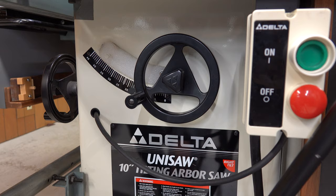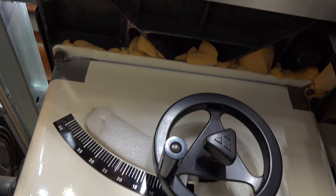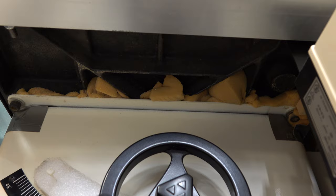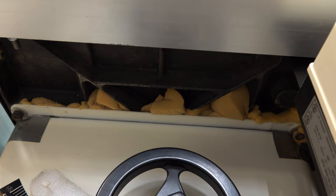Number 12 is sealing up the underside of the table saw. Maybe pieces of foam, duct tape, whatever you'd like to do to seal up all those areas between the cabinet and the top of the tabletop. It will boost your vacuum dramatically, and it will have the mess be almost nothing when you're all done.